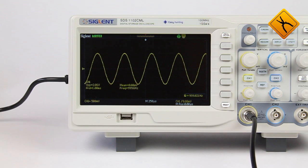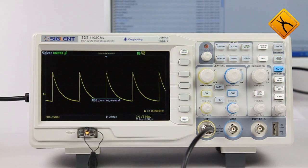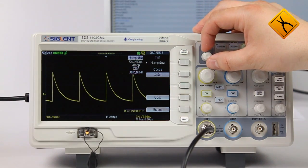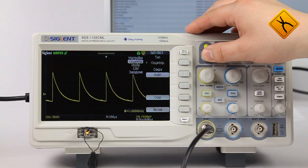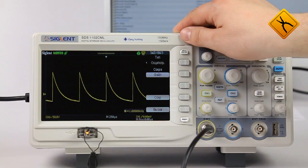Oscilloscopes are nowadays often referred to as digital storage oscilloscopes. You can save waveforms on removable storage drives like USB flash drives with FAT32 file system. The Save menu can be entered by pressing the Save or Recall button. In the Type submenu, you can choose the format of saved waveforms and general device settings. Waveform menu items allow saving data in an internal system format, to either internal memory or an external storage drive.